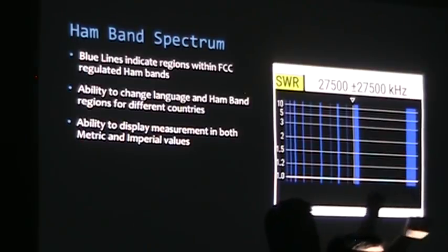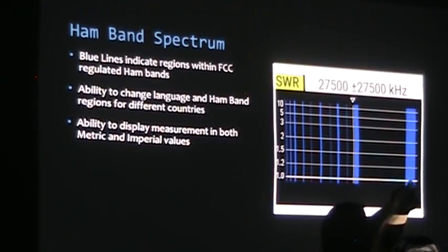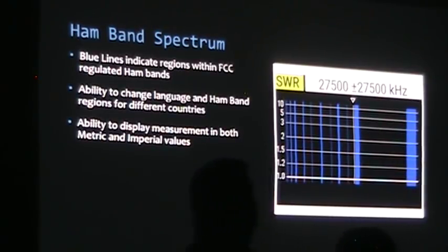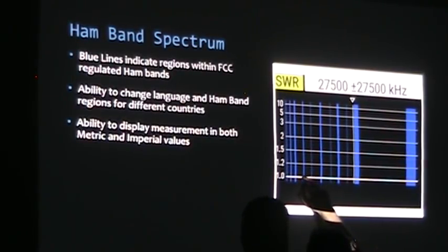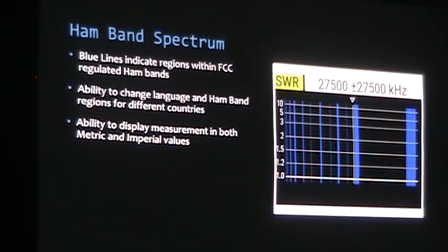That's why these are called zoom analyzers — they have a zoom function. You can zoom into a specific band, like 20 meters here, showing the center at 1.23 SWR at 14.175 MHz within a 500 kHz window — nearly the entire band. The zoom function works in two ways: you can zoom in on the bandwidth, and also zoom in on the value scale. Without taking a new measurement, you can zoom into a portion of an existing sweep to examine it in more detail — in this case, narrowing from 250 kHz to 100 kHz around the area of interest for a much better view of SWR versus frequency.